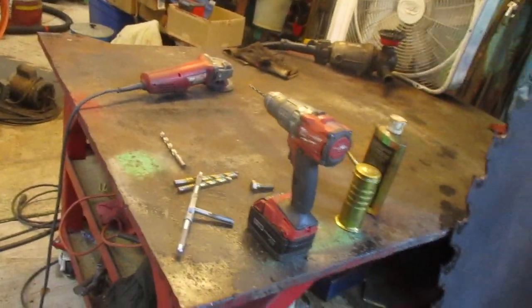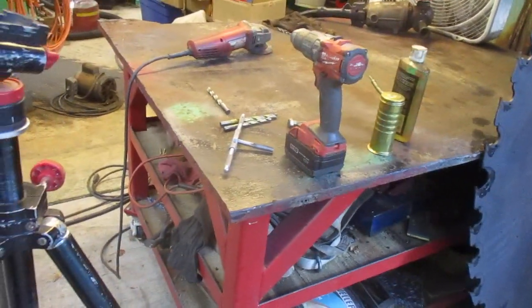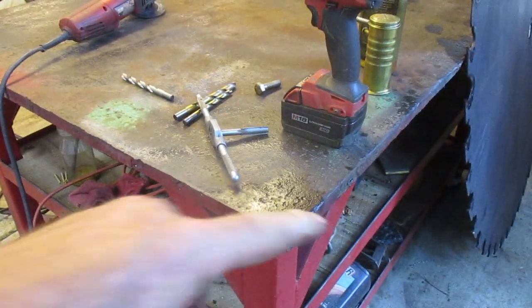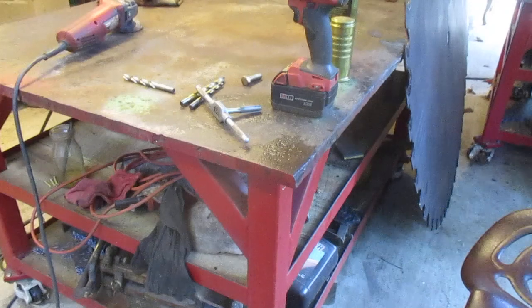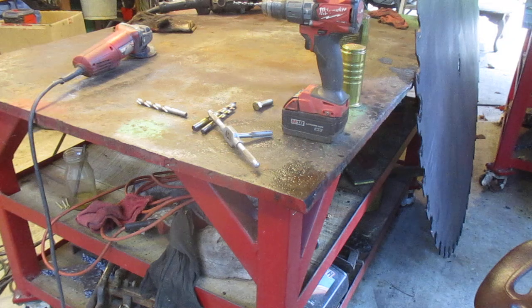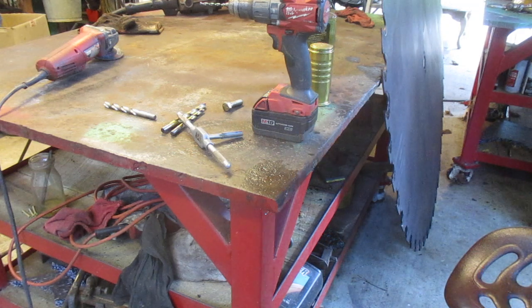The weight of this thing's kind of hurting me. What I'm trying to do is make a saw bench for saws. These are those big heavy tables I made — one-inch pieces of steel. What I'm going to do is just drill in there, drill bigger, then run a half-inch fine thread tap in there and put a pin out there with a loop on it. I might find that this hole turns out to be pretty good.